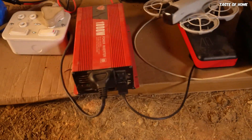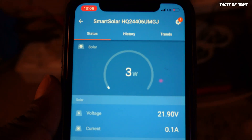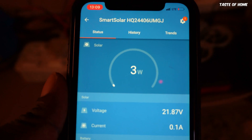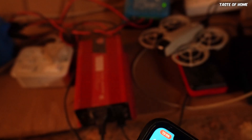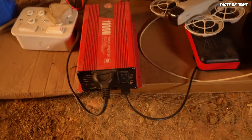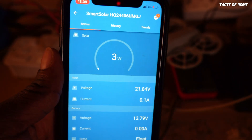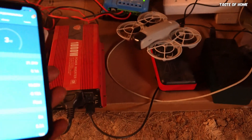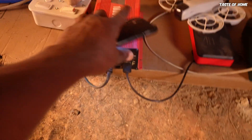I've taken off all the devices and switched off my inverter. If you look at the app it's now at 3 watts — the charge controller is only letting 3 watts go into the battery, which is barely any power because it's in the float phase, just keeping the battery fully charged. Now if I switch on these devices they're going to draw some power, so that 3 watts is going to increase slightly to compensate. I'm going to switch on the inverter now.